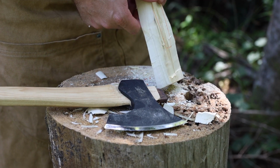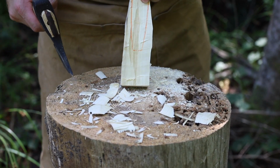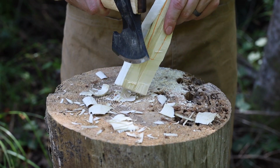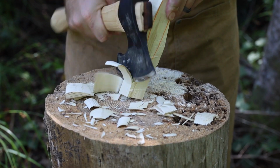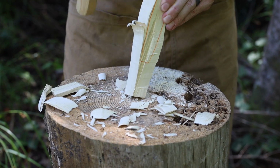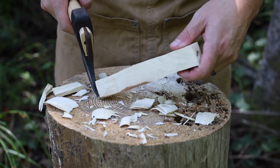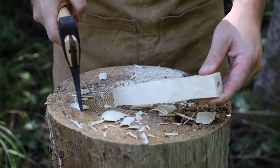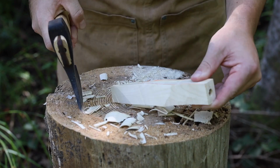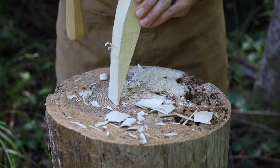As I chop, I'm coming in from the widest part of that barrel shape, going the opposite direction each way so that I'm not cutting down into my grain. I'm working with the grain of the wood so I don't split anything off. So you'll see me flip the blank back and forth a lot so that I'm always working from that highest, thickest point in the wood.